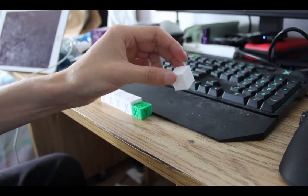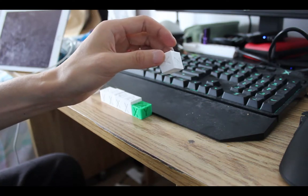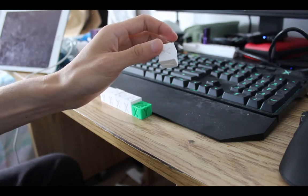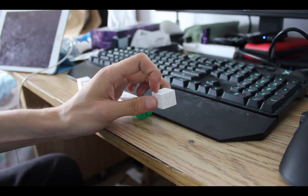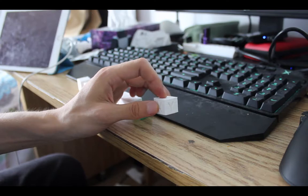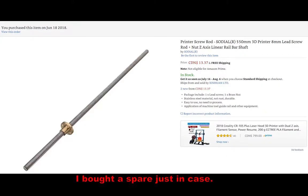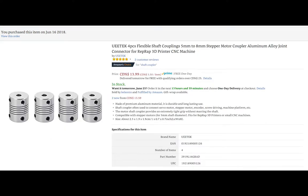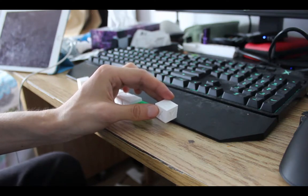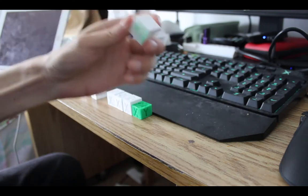Now I was lost in how to fix this. This problem is only in the Z direction, so the only possible things that can change the Z direction is the lead screw and the bed. There is also the third option of the Z limit switch. I believed the bed was fine because if I raised it too much the print wouldn't stick. So then I thought about exchanging the lead screw — but I just exchanged the Z coupler instead, which was a much easier exchange. But it still had a problem. This print was made with the Z coupler exchange.